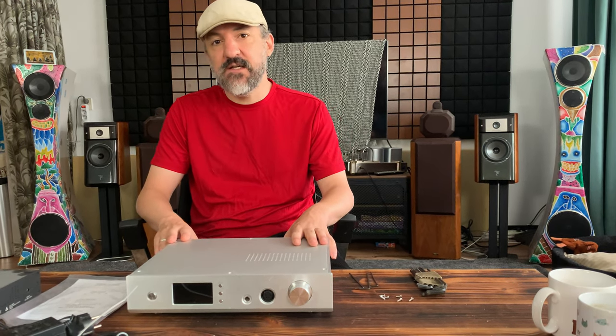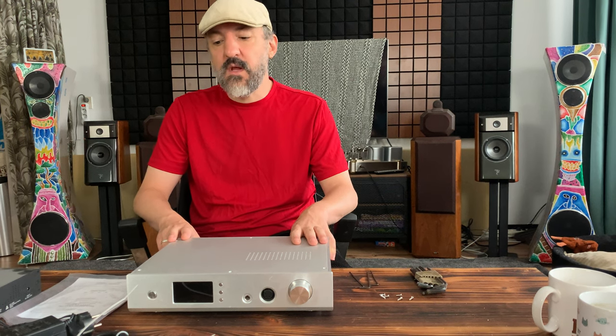And what we're going to do is a visual inspection. Now, before I start, I want to warn you, working on old vintage electronics can be dangerous. These things hold a charge for up to 24 to 48 hours. The charge is easily enough to kill some people. And what you need to be careful of is large capacitors and some of the tubes.